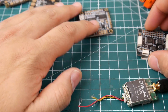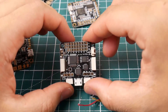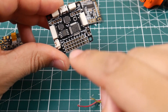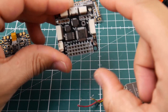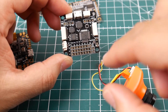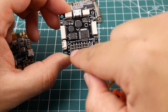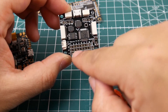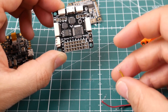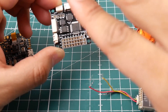Now let's take one that's a little bit more tricky - one that has no OSD. Here's an SPF3; this has no OSD, there's no cam and there's no VTX pad. Since we powered up the 5V rail through the plus and minus, the whole rail is now 5 volt and ground. So for the camera, put the black wire to ground and the red wire to the plus. You're still left with a yellow wire, so what you do is take that camera yellow wire and the VTX yellow wire, put them together, solder them, put heat shrink on, and you're good to go.